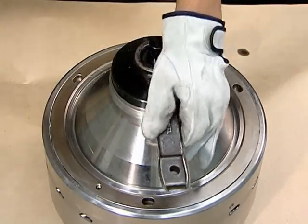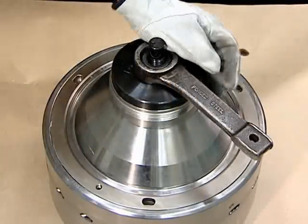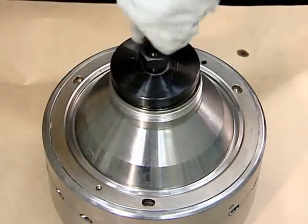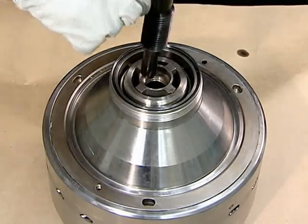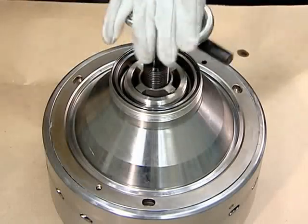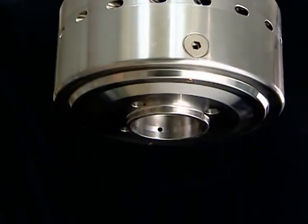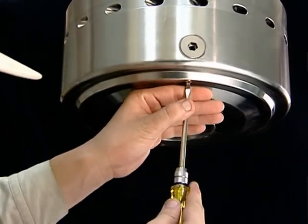We will now explain the procedure for mounting the bowl on the self-jector. Before mounting the bowl on the self-jector, remove the disc clamp plate. Set the bowl lifting jack on top of the bowl head and lift. With the bowl lifted up, inspect the two drain nozzles mounted on the bottom of the bowl.